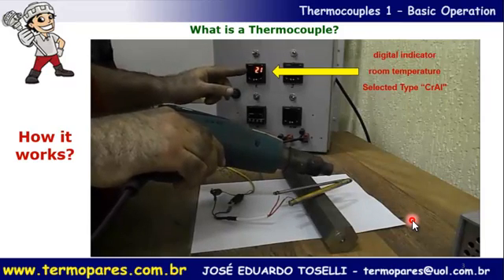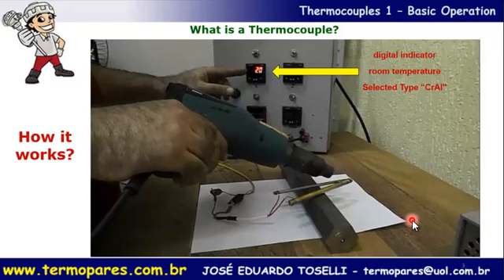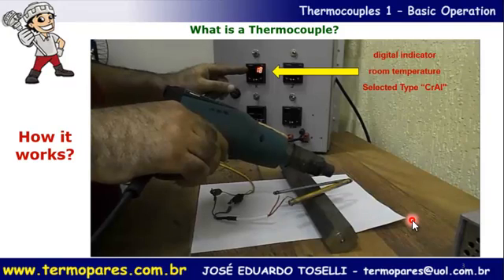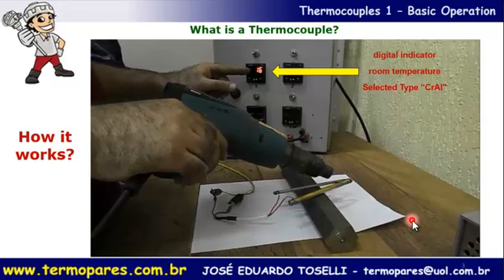Note that when heating, the temperature on the indicator decreases. The temperature decreases because the cable connections are reversed. This can also prove whether the two tubes are the same material — if no voltage is generated, the tubes are the same material. When voltage is generated, the tubes are different materials. The temperature continues to decline.